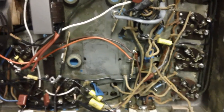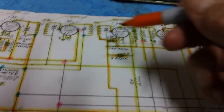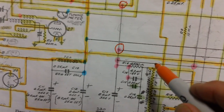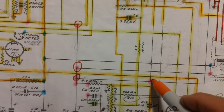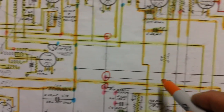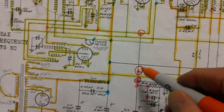While we're waiting for the old soldering iron to heat up so I can extract this wire and get the solder off, let's circle the contact points we're going to be actually connecting together. We're going to connect this one, this one, this one, and this one up to pin 4, right here. And we're going to connect over to our speaker plug. When we get done, we'll have 1, 2, 3, 4, 5, 6 connections.